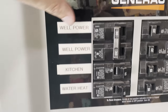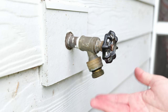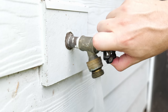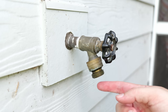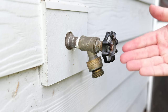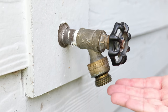It's down nice and tight, so now I can go turn the water back on and test if it leaks anymore. The water is back on — as you can see there's no dripping. I can turn the valve on and water comes out; when I turn it off it shuts off. There will be a couple of drips until it drains out of the faucet itself, but we're not having that consistent drip like before. This hose bib is back up to basically new condition, because it's always the seal inside that goes bad and is ultimately responsible for whether water flows through.